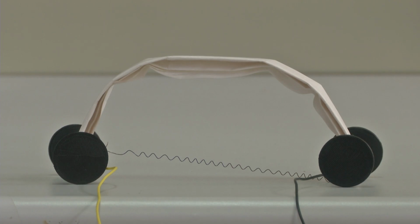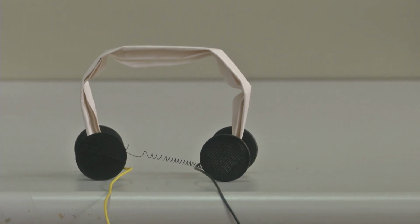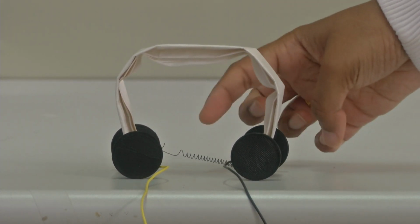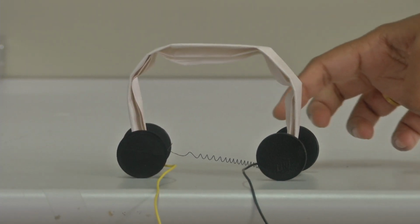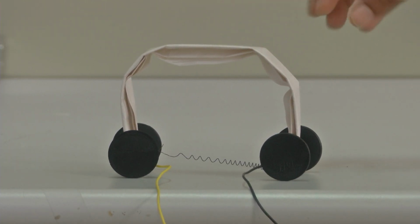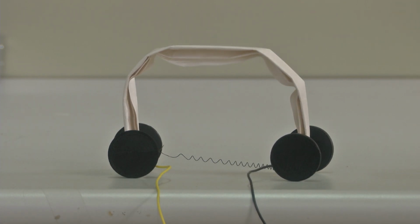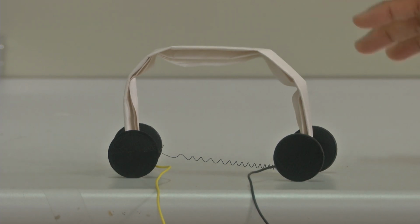So now if you see what happens as you supply the voltage to the actuator, you see the actuation mechanism, it's literally dragging through the wheel. This is nothing but the trained state. In the previous module, we had trained the SMA by winding it. So as you see, it is expanding. So the austenite and the martensite, upon cooling, this is nothing but the martensite phase. It goes back to its original shape.